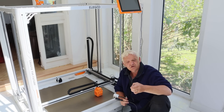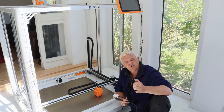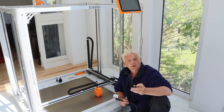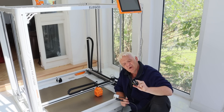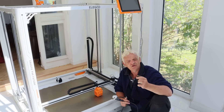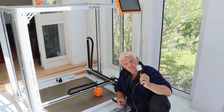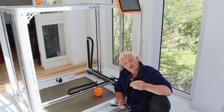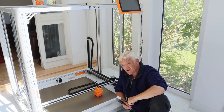When I chopped off the end I discovered the wire color coding was according to UK/European standard: blue for neutral, brown for live, and green and yellow for earth. But there's no guarantee those go to the right prongs, so I did a continuity check — and they do. It was a piece of cake to rewire the plug to UK standard because they've used the correct wires.